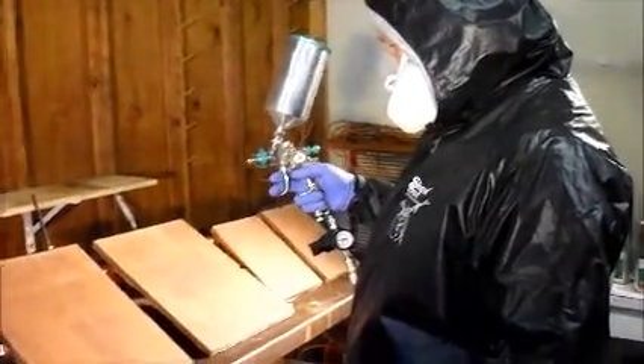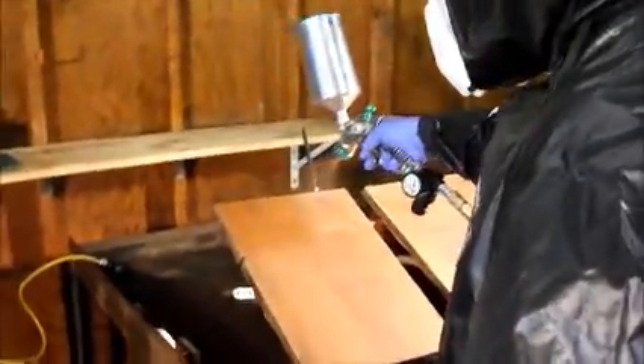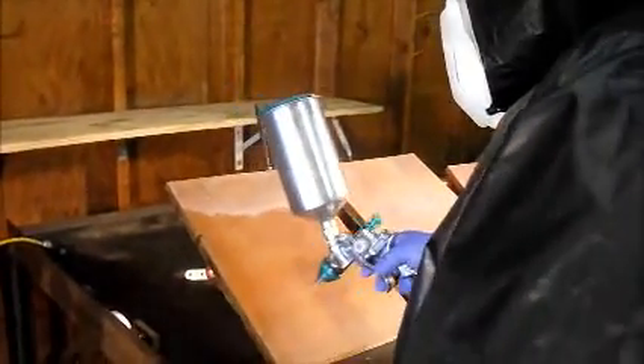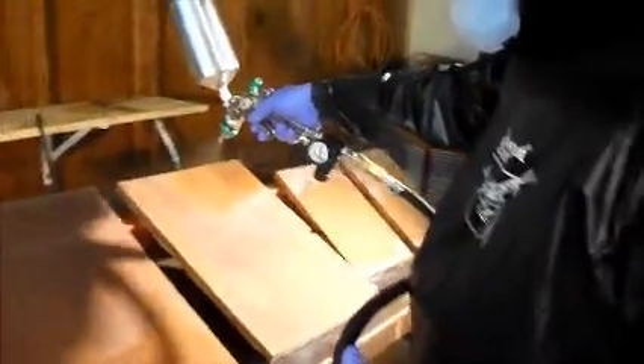This is the same gun setup as the bottom coat — we just adjusted the air down a little bit. This is Gary Strach again getting ready to apply the top coat. Remember, the pattern is the key when putting it on. The top coat only sticks to the bottom coat, so you can't just spray the top coat on alone — it has to have the bottom coat. You can see this stuff dries a lot quicker, and you can really see your pattern once it starts drying. It has that white haze to it, letting you know it's drying, and it does go pretty quick, so you don't have to wait very long between coats.